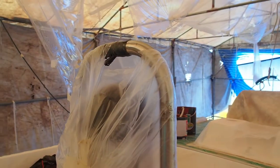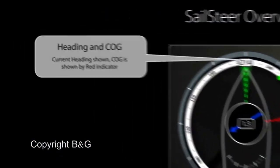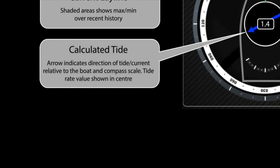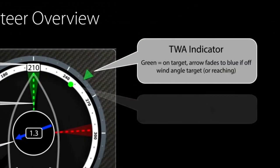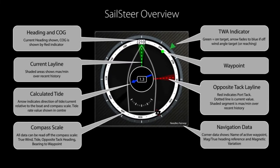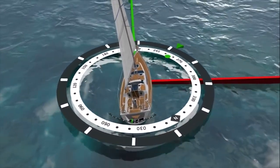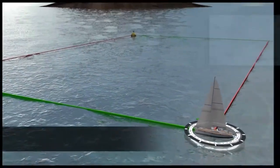On the binnacle we're going to have an 8-inch touch screen chart plotter, and that's in addition to the 12-inch one down below in the chart table. Why do we want two chart plotters? We've never had one at the binnacle before - it's a bit of a luxury, but it saves having to run up and down to the chart table when coming into harbours, new places, coral reefs and so on. It just felt safer to be behind the wheel at all times with that information in front of us. Also, having it down at the chart table means we can do passage planning when the weather's bad. Fortunately with the B&G system and an ethernet cable the two can talk to each other, so you only need one set of chart data shared between them.